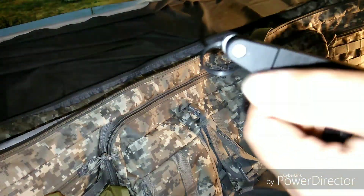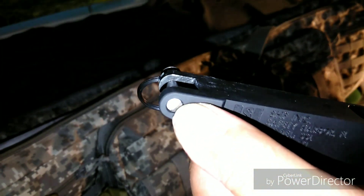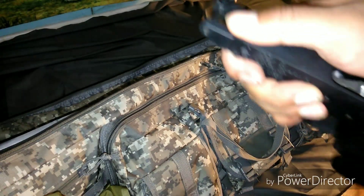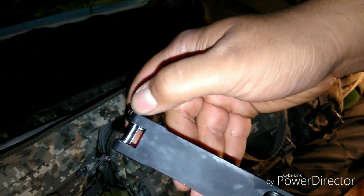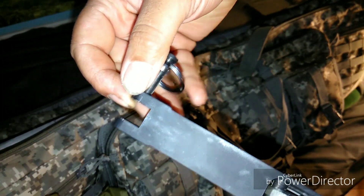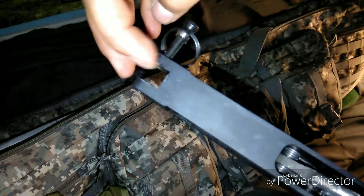So now when they're pushed in, they both seat all the way in. Now I noticed this here — this is the next mod I had to make. This here is recessed just a little bit, but not too much. And the reason that it's recessed like that is these ears here. The ear here is a little bit thinner than on a normal AR. So when you pull this pin out, the pin stuck out too far, so you couldn't take the lower on or off.